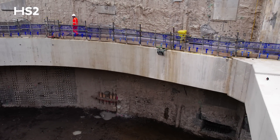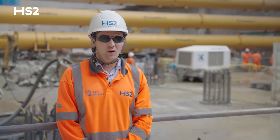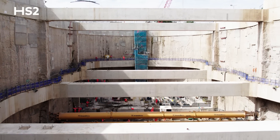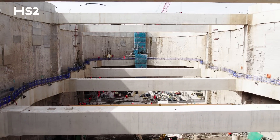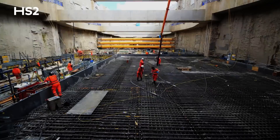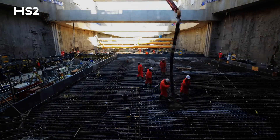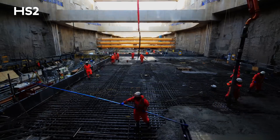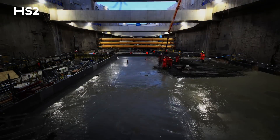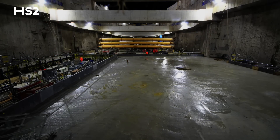We're now at pit bottom of the box. Ahead of me will be the tunnels that go out towards Green Park Way and West Ruislip, and behind me is the route that will go into Old Oak Common Station. Where we're stood right now is on the first base slab of the box. We poured this last Saturday — it was our biggest pour to date at 1,385 cubic metres. It took us 16 hours to pour, and we've got four more equivalent pours to do before we launch the TBM. This is the final stage of construction before we build the headwalls, which my colleague Ben is about to talk to you about.